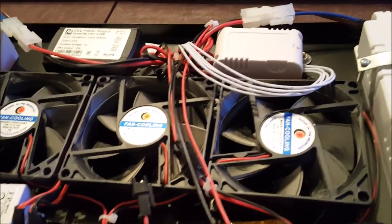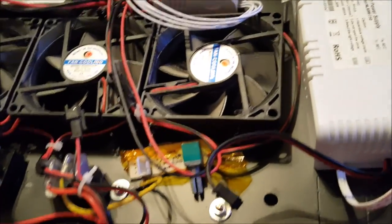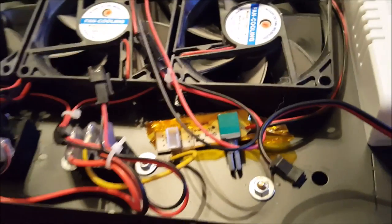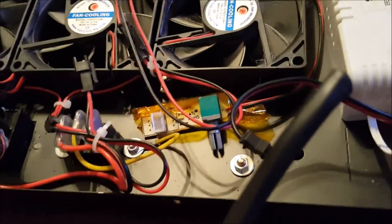All right, now to get from the bus, which is going to be hooked up to the Apex, to the actual units, I'm going to run wire through the small hole that we just emptied out by removing the dimmer pot. And the cheapest thing I found that works well is to go to Home Depot, and for about 12 bucks, you can get 50 feet of 7-core wire. Now, it is stiff wire, so it's not something you want to bend all the time. So if it's in a location where you're constantly moving it, you might want to go with braided wire. It's a little more expensive, but the solid wire definitely works.